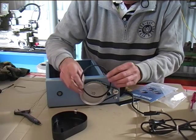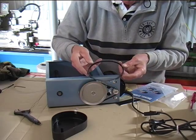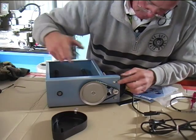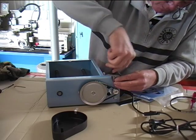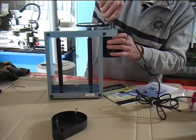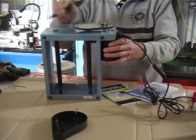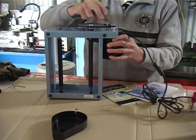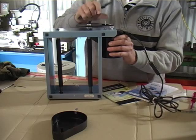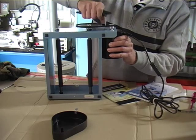It comes with a cog-type quality belt — it's a Gates belt. It usually lasts a very long time, but eventually it will wear out or need to be adjusted. To adjust is quite simple: there are two acorn nuts, top and bottom of the motor. Simply loosen those off, and you'll see when I push that in it actually loosens the belt. Bring it across to the correct tension and just nip those back up again. It should be around 12 to 15mm of movement in the belt.